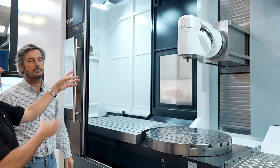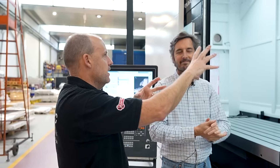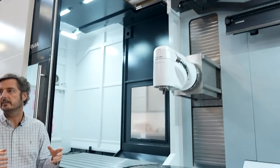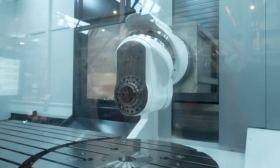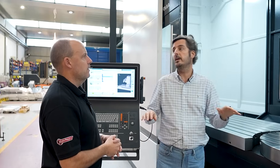What about the wires and cables inside the head when it's doing all these maneuvers? This is one of the best parts of our UAD technology — it's a pure mechanical head. We don't have any electrical cables inside. Everything is managed mechanically with gears and clutch systems. As a consequence, we can rotate the two axes of the head without any limitation.